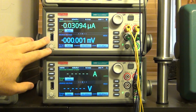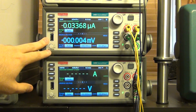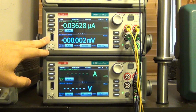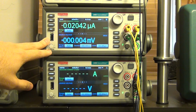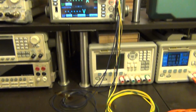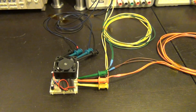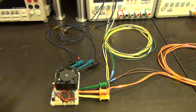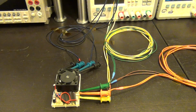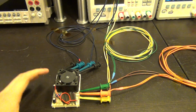So this is going to absorb current from the regulator and tell us basically what voltage it is reading based on how much current it is taking. So basically like a precision load. And because they are connected together at the back with the scripting capability, we are able to run this whole test in one sweep and get a complete two-dimensional monitoring of the performance of the regulator.